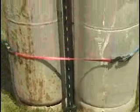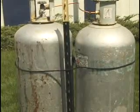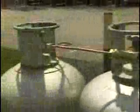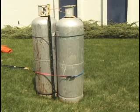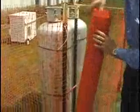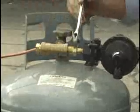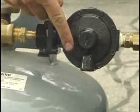Requirements may vary from state to state and city to city, but safe installation and usage is the common goal. A 100-pound LP cylinder is the minimum size required to run the Premier 80 and 170 heaters. The 350 requires a minimum 500-gallon size. The gas company delivers two 100-pound cylinders, which will be manifolded together to ensure an adequate fuel supply throughout the event. The propane gas containers must be placed on a stable, flat, level surface and secured to prevent tip-over. Make sure the gas containers are placed at least five feet from the nearest tent wall structure. Additionally, fencing or other suitable materials must be used to prevent unauthorized access to the containers and to protect from vehicular traffic. When the cylinders are positioned properly, the next step is to connect the regulator and gas hose with the regulator vents directed downward and all connections securely tightened.